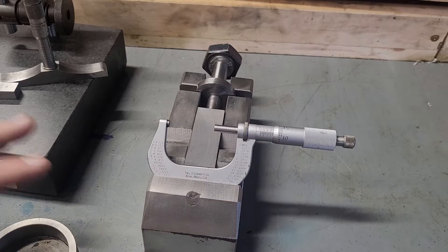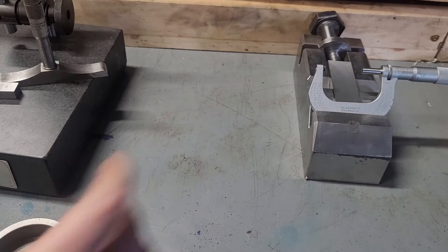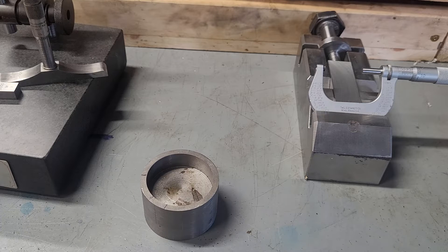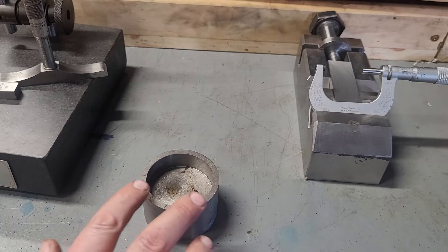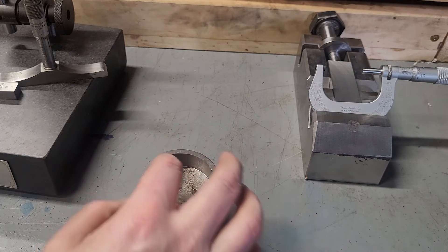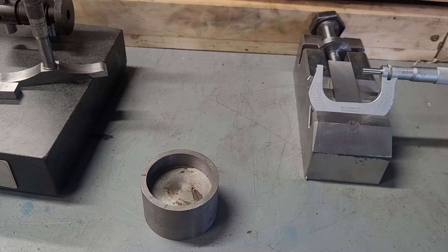The first situation is there can be times where you're boring for a wall thickness. Most of the time it's your inside and outside dimensions. If you're pressing this in as a bushing, it's going to shrink, and your interior dimension kind of doesn't matter. Also, measuring the wall thickness in a few different places actually does give you a good idea of concentricity — the inside and the outsides — without more complex inspection.